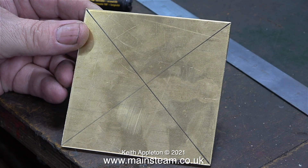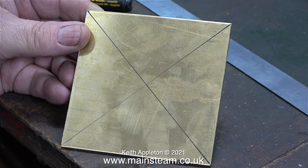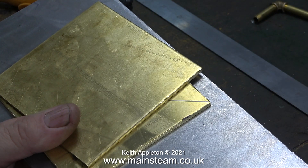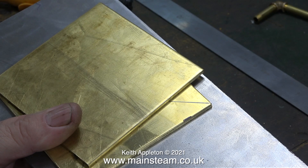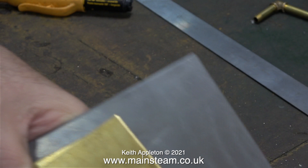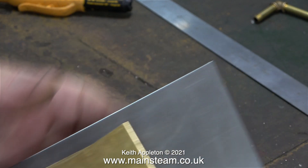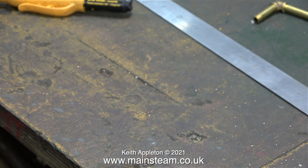While it's cooling in the outer part of the workshop, I'm in the inner part of the workshop marking out the top cap and the base for the condenser. A word of advice: when handling metal that's been cut on a guillotine, some of the edges are razor sharp. So before working with the parts, I took them into the outer part of the workshop and cleaned up the edges using my 4-inch belt sander. I feel this is a very important thing to do, having cut my fingers many times on sharp pieces of guillotine metal. You live and learn.